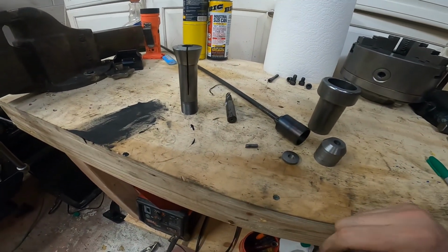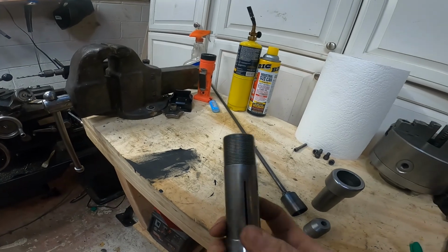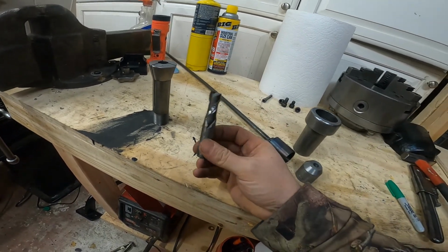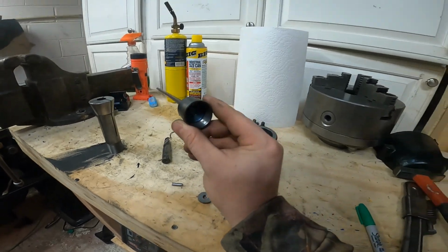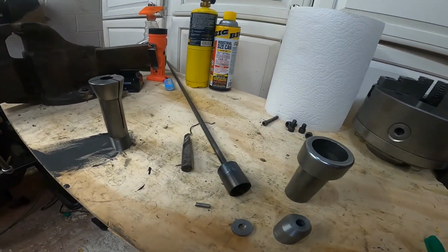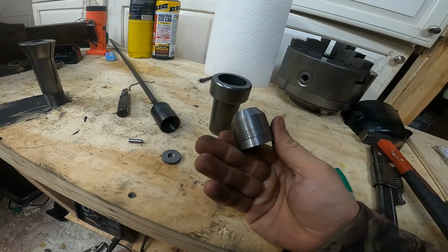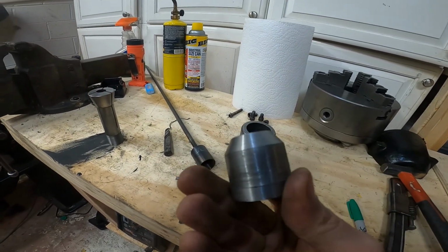Here's what we got. We have a 5/8 collet, 1 1/8, 20 thread. That's the original Pratt and Whitney collets. I have a 5/8 end mill. That's the only thing I have laying around that'll fit in that collet. The new nut I made, internal threads welded to a 3/8 rod, the collet holder, a cone. Now the cone idea here came from Kimber Zellick. Phone conversation with him. Good idea.